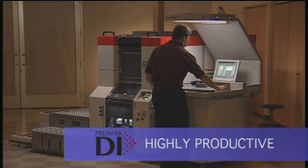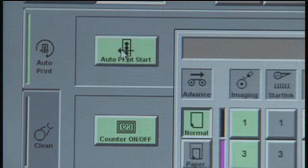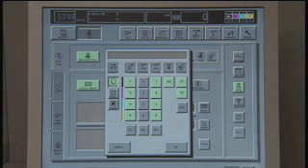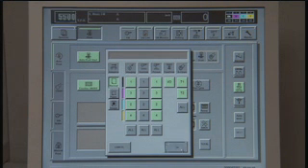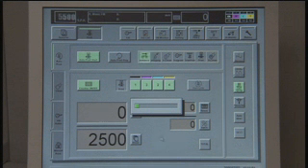All of this will be performed without user intervention. The automatic print mode is engaged by clicking Auto-Print Start. The DI's graphical user interface prompts the operator through the steps. He verifies that he wants the press to image and clean the four printing plates and preset ink fountains for this specific job, print test sheets, and finally clean the blankets automatically. The operator verifies these parameters, clicks OK, selects the specified number of sheets for the production run — and off it goes. That's all there is to it. Once you select the job and click OK, the press automatically takes over.